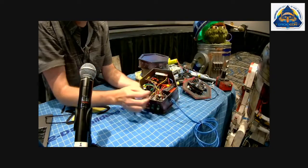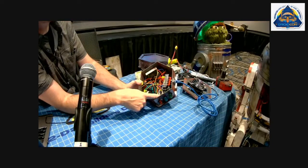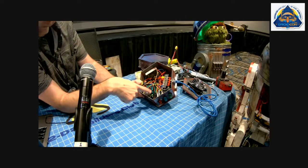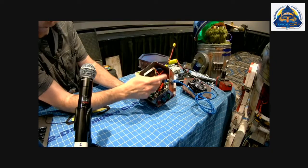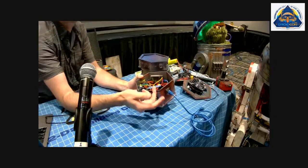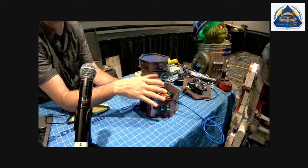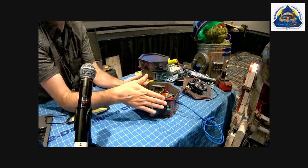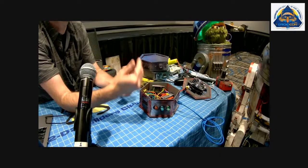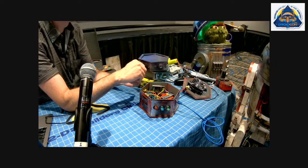And then inside of here, once I get that tidied up, it'll be a lot cleaner to see, but you've just got your connectors going to your switches, into your motor controllers, and you're getting power in. And then your signal comes from the Ethernet jack and goes to your siren and your saber tooth. And so the idea too being, say I could make an amp, I could make a power thing, but I don't even know what I'm doing with the motor controllers. Somebody else could build just this module as long as it has the right input and output and send it to you. And you can kind of collaborate that way on specific components without having to have the entire board shipped around.